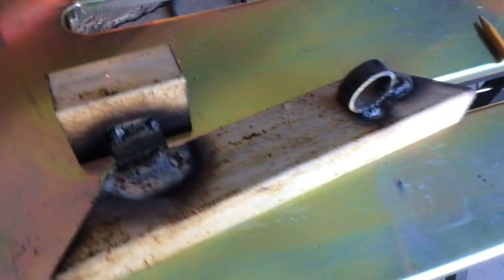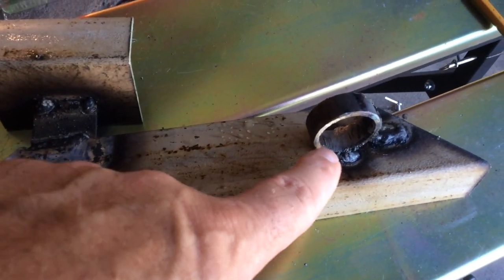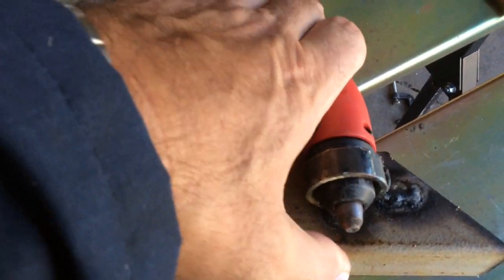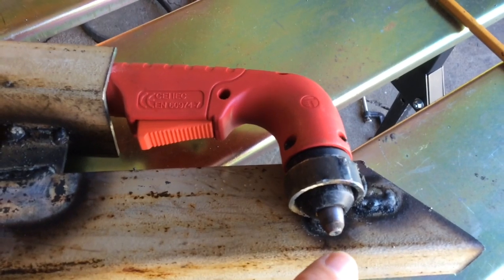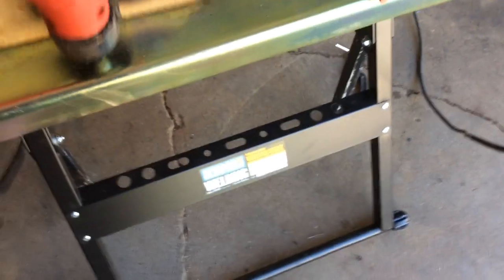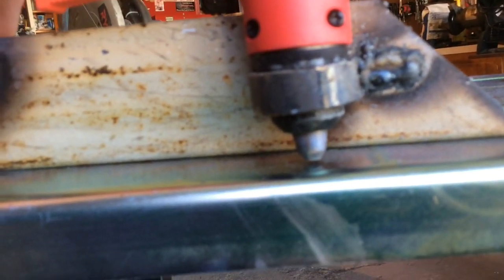I've got this welded up - I need to do a little cleanup on it. One of the most critical aspects was putting the pipe nipple in the right place and also the positioning of the handle, because the tip fits down through there and this rests on the handle. One of the critical measurements is from the tip down to the metal that you're going to be cutting. Some tips can sit right on the metal, but my manual calls for a slight space - about a sixteenth of an inch - so I had to get that just right, to where it's just above the metal I'm going to be cutting.